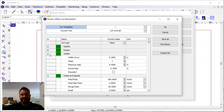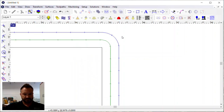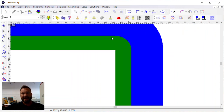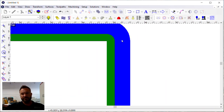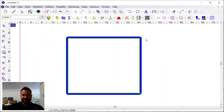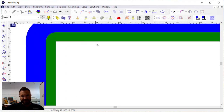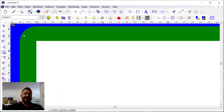The difference is here in Widths. The default for a clean pass width is half the diameter of the tool. In this case, using a half inch tool, it's going to give us a quarter inch clean pass. Click OK, click OK again, and zoom in — you should see that green line, which is our clean pass. The first tool comes in and automatically offsets itself by a quarter inch; you don't have to think about it after this setup. It goes around the part, then comes back and takes off that final quarter inch of material. That's how you can get an even better finish by taking off less material.